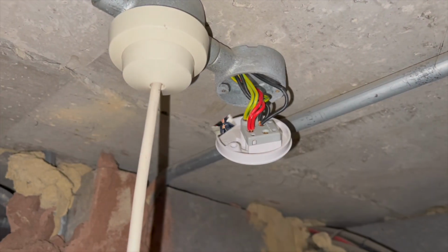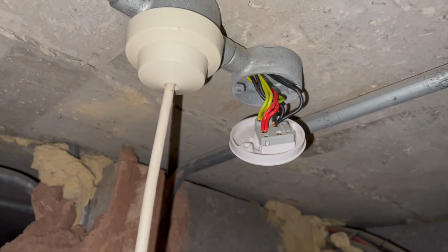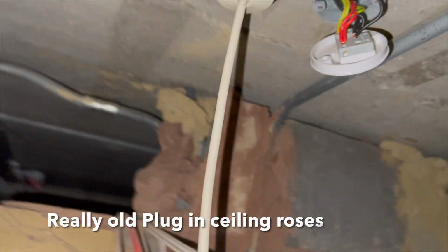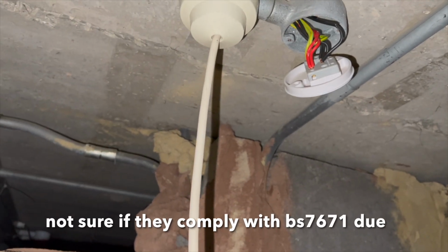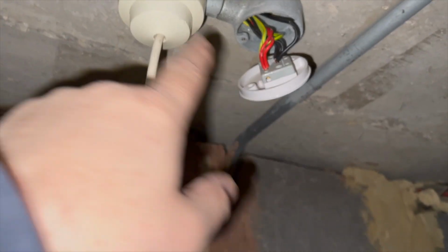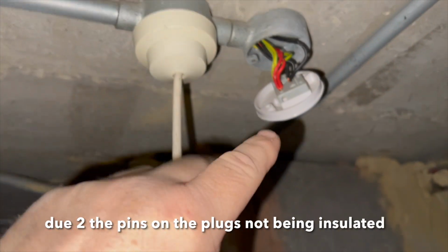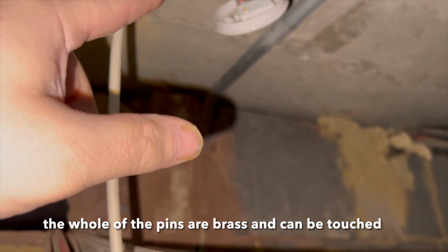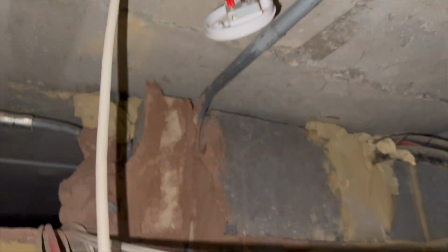Should be. Yeah, so what we're hoping with this, Jack, is there's two of these rock roses, what we call them. They're two next to each other, and what they always used to do is have an emergency one and a standard one. So I'm hoping that's what they've done. Then we can literally just pull the switch line over to that one and create an emergency one.